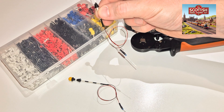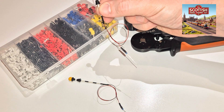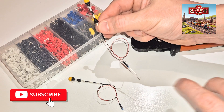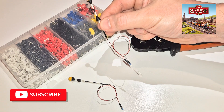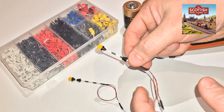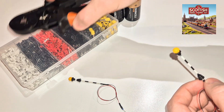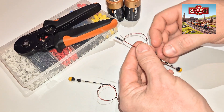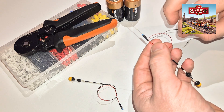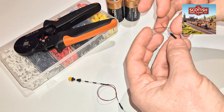I was assuming I would have to cut the resistor off for the three volt version, but however you don't — so it must be that in this instance I've selected the three volt version and they've already got the resistor there. I'll show you how I know that: before I did anything I thought I would check the red wire and the black wire against a 1.5 volt battery to see what happened. I expected nothing to happen because it was only 1.5 volts.